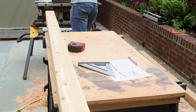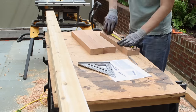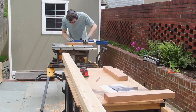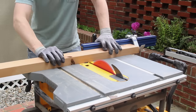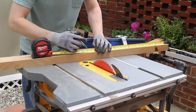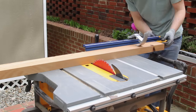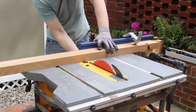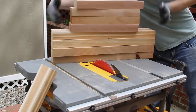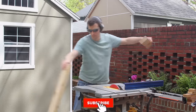I'm using some different scraps of 2x4s from previous builds, so I just picked out the best pieces to limit waste, measured the vertical leg pieces, and then set my stop block to make repeat cuts. I did the same thing for the horizontal leg pieces, but I had to use a clamp for the stop block since the pieces were a little bit too long for my built-in block. You could definitely use a circular saw or a miter saw for these cuts — I just like using a table saw because I find it a bit faster and easier to sneak up on some cuts. Finally, I cut down the two long top side stretchers.